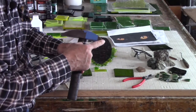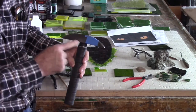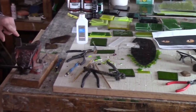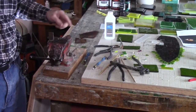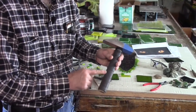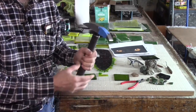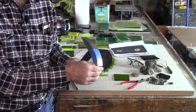The hammer I use has one side that is carbide and the other that is just steel — one side is for cutting stone and one side is for cutting glass. I have a sort of portable hardy because I use just a steel chisel, and I do that because I'm using lots of stone that's considerably denser than usual and I need to resharpen the chisel surface while working on the stone. I've also wrapped my handle with a shock-absorbing wrap usually used for tennis rackets, which lets me grip it well and also reduces the percussion of the process.